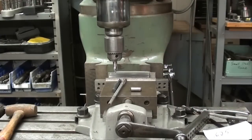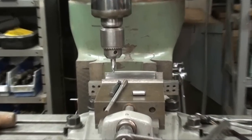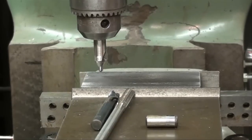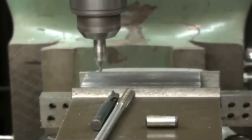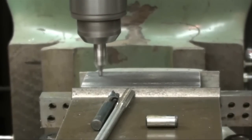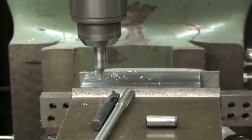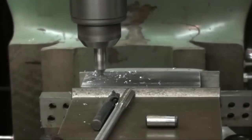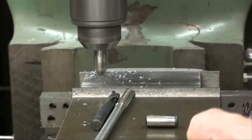I've got a bigger center drill in there than what I did last time. I think that might have been the entire problem because that's not going to bend, it's not going to deflect. So I'm going to center drill four holes. The table is locked, the digital readout is on zero. There's my hole. And I'm going to center drill them good and deep.